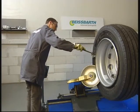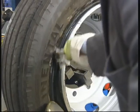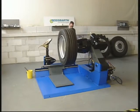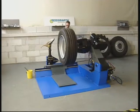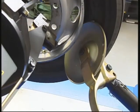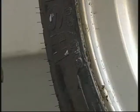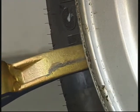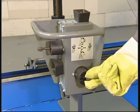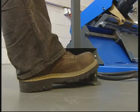MS75 SA is a machine with outstanding features, such as the following decisive benefits. All work cycles are supported or automated by electro-hydraulic or pneumatic systems. Result: economic, professional and tire-saving work. The hydraulic pressure of the clamping jaws is infinitely adjustable, which allows for the careful clamping of lightweight metal rims. The equipment is operated from an easily portable control panel. Wheel rotation is done with pedals, so the operator always has one free hand.